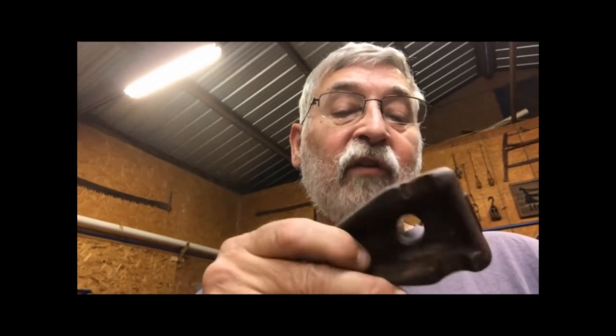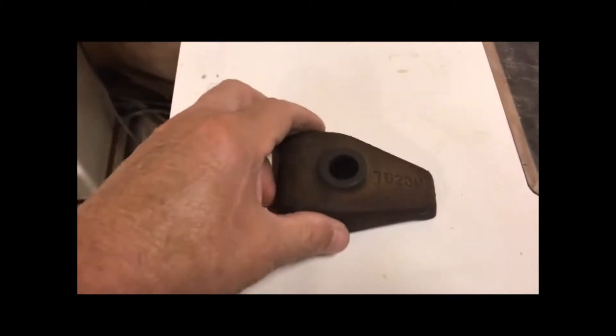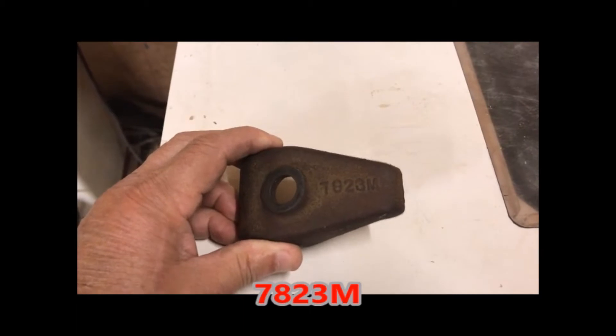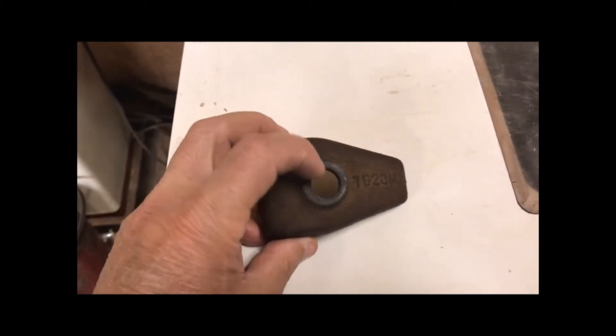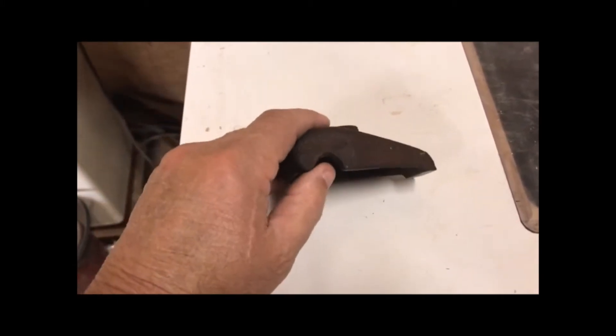This is an original that I have on another sulky that I was trying to come close to. I have this clamp piece that I was searching for for the David Bradley. I haven't found any used examples where somebody is parting something out. It's part number 703M — the clamp for the David Bradley hitch. The bolt comes through here into a turn handle which tightens it down on the saddle.